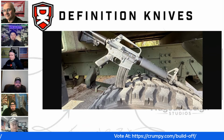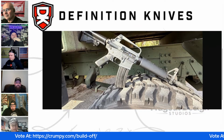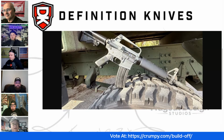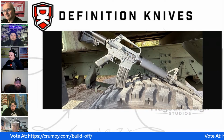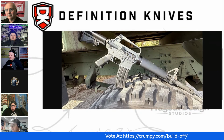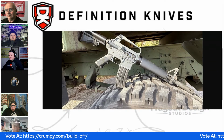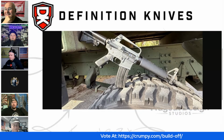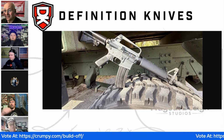And I tried to, oh God, it's Duracoated. Every normal AR is all black, and I like that grayish old school looking AR finish. So I started looking at Duracoat stuff, and they didn't have a named color for that. I saw something that looked like it, and it came. I did that painting by myself. I blasted it, and I have a small spray booth. I shot it in the spray booth. It came out perfect the first time. I was so impressed with myself, because sometimes you get a run or something like that, and you have to start over.